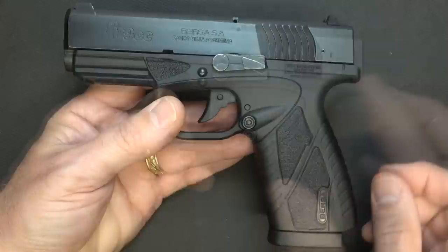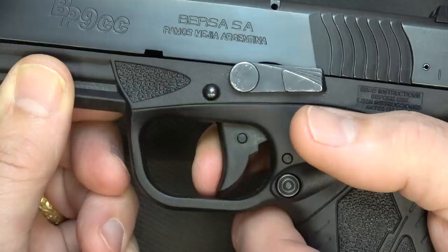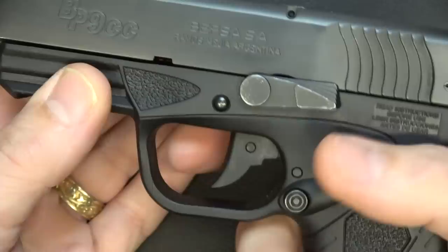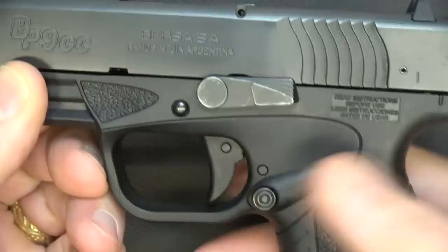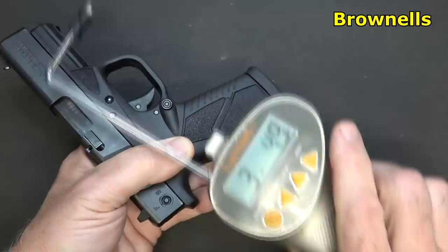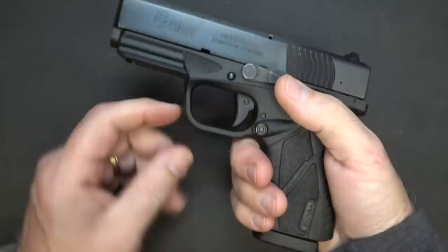The action of this handgun is very smooth, but one thing that to me is a big plus is the trigger. It's double action, but it's what they call a short reset double action. The trigger has a little bit of free play, then right there you have some resistance — about one and a half pounds — and you come against the wall. Then there's a nice, crisp break, and the reset is really fast. Using the Lyman trigger gauge from Brownells, we measured: one and a half pounds to the wall, then the break at approximately three pounds, four to six ounces across multiple pulls.